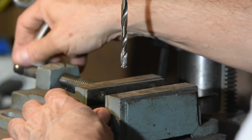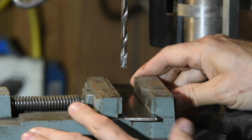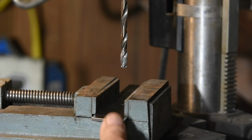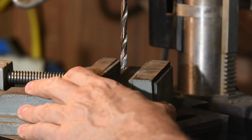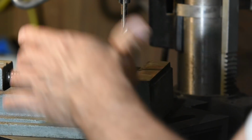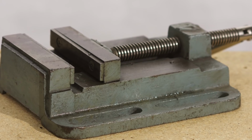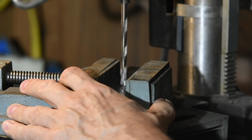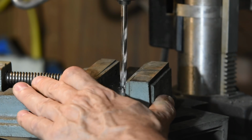However you do it though, before shaping the blade, I always drill the holes in the handle. I do it in this order because it's easier to support the blade much more firmly in the drilling vise when the steel's still square than when the blade's irregularly shaped. You can buy El Cheapo drilling vises like this for a song, and they really improve the quality of your drilling. If you have a drill press but don't have a vise, I highly recommend that you get one when you get the chance.